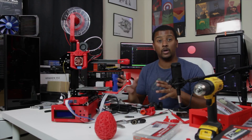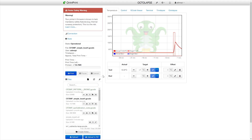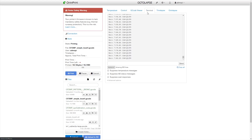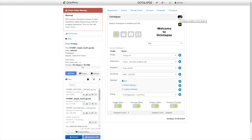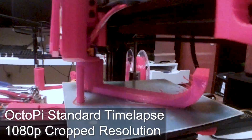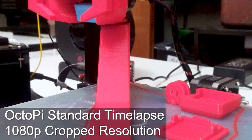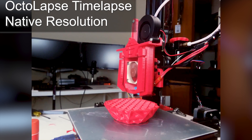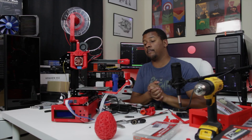It's been great. I can monitor my prints from anywhere because you can remotely connect to your server from outside of your network, or remote into a local computer to bring up the web interface. You can send prints to your printer remotely, pause prints, and if you see you're running out of filament — just a huge amount of functionality. Time-lapse is built in with the Pi camera, so not only can you monitor your printer, but you can have it take a picture every layer change or every X seconds. There's a really cool plugin called Octolapse which allows you to move the print head to a certain position before taking the picture so you can get really nice time lapses.